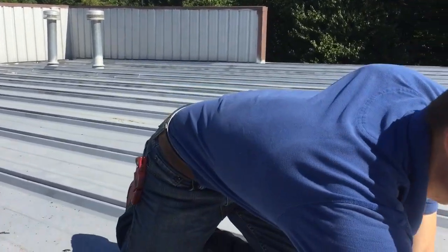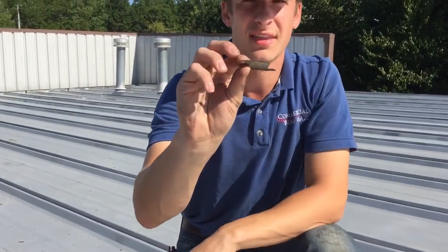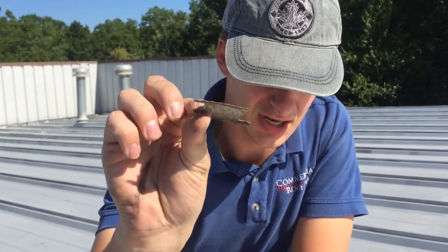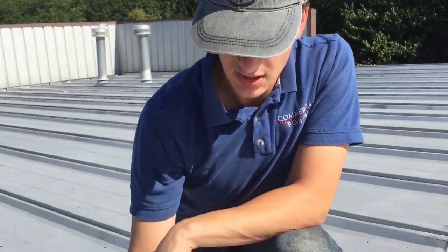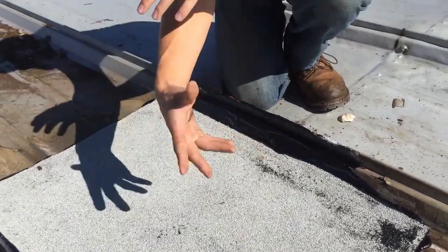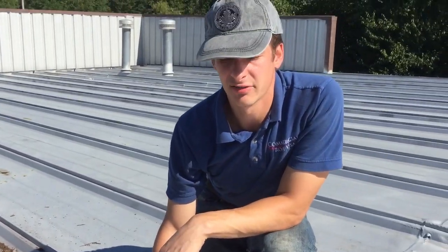The silicone — I don't even know how thick that is, but you can see. Let me grab a piece here. You can see how thin that is. That's going to get eaten up by UV rays in no time. Our membrane already has UV protection and it's 3 millimeters thick, as well as having petroleum-based adhesive underneath that, which adheres to metal very well.